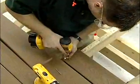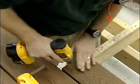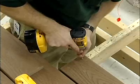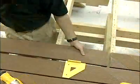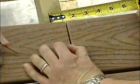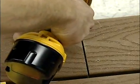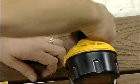Line up your first board in the center of the joist and the small framing board. Install fasteners and screws at each joist of the first board, including the joist at the seam. Then install your second board in the same fashion. Make sure you follow end-to-end gapping specifications, and place a second fastener at the seam, attaching it to the small framing block.